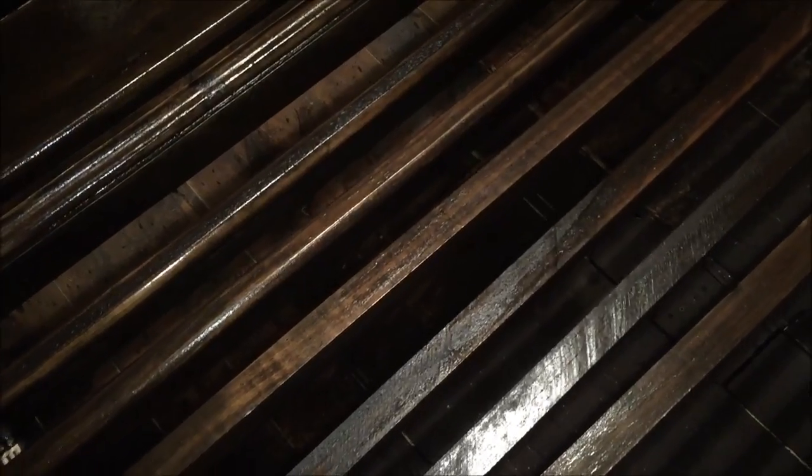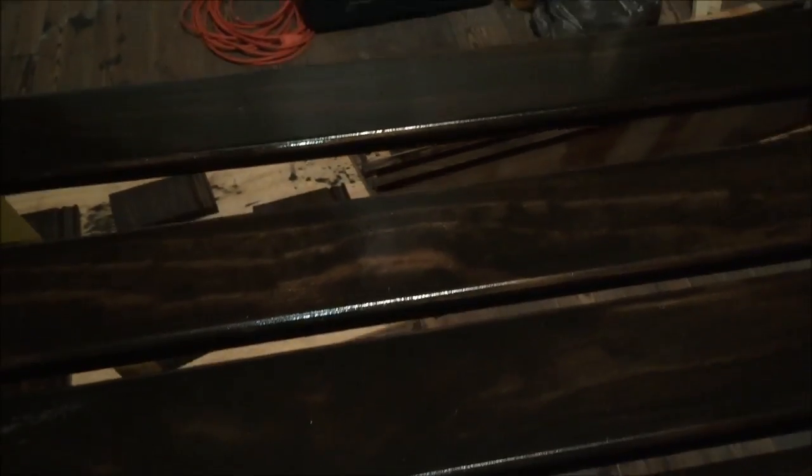Okay, I know it's really dark, but that's the point. We like the dark wood. I've got it all polyurethaned. It was still doing the same thing. It was basically all the old pieces, these smaller pieces, they were pulling the stain up with it and streaking it. So I don't know what the deal is. Usually I wait 24 hours before I polyurethane stuff, so maybe that's it. But the pieces that I'd already done before, the big wide pieces right here, they were dry enough to polyurethane again, and they came out really nice.